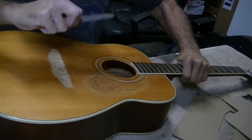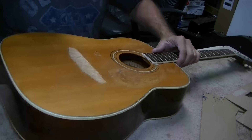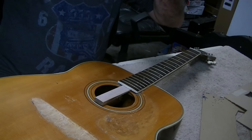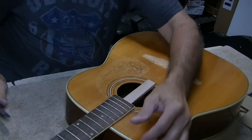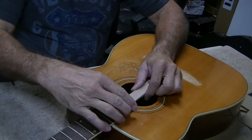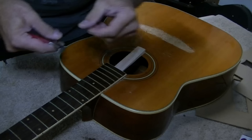I made this larger tool and I'm going to try it under there. The little tool is a lot easier to push, so I'm going to heat this one up some more so it'll melt the glue as it goes in there better. I put that wedge in there to hold it up and I'm working on these corners to try to get it off over to the dovetail joint. I think the extension is loose — I'm going to let it cool off a little bit so it doesn't glue itself back down before I let this wedge out.